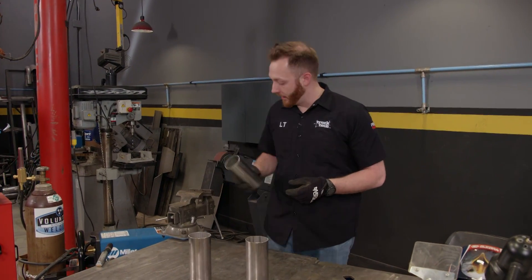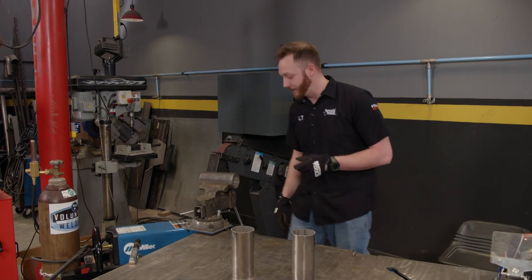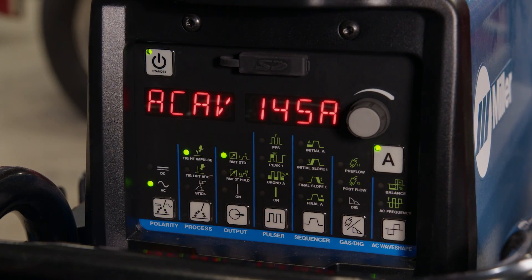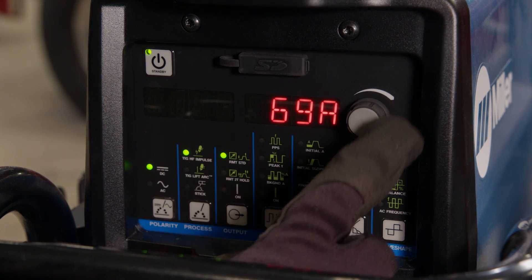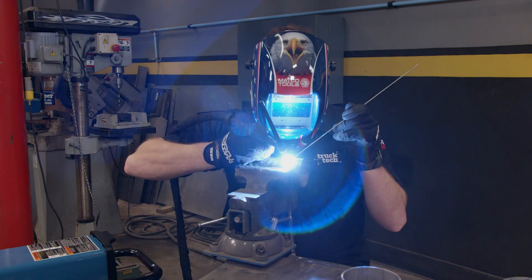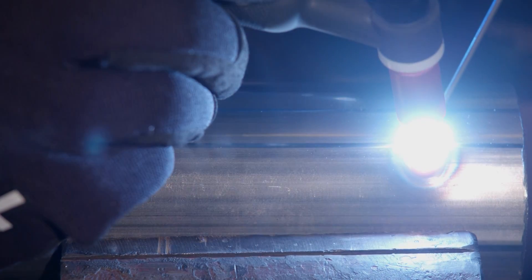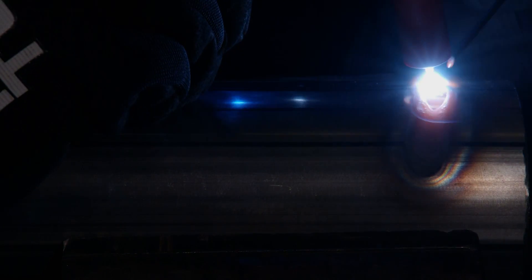To show you what I'm talking about, I'm going to run a couple passes with the machine set up improperly so you can see what I mean. The machine is set to weld DC because that's what stainless requires, but I'll set the heat range much higher than what's needed. I'll then run a few passes on the pipe, intentionally pumping in a lot of heat and moving slowly, making a couple of beads about a few inches long.